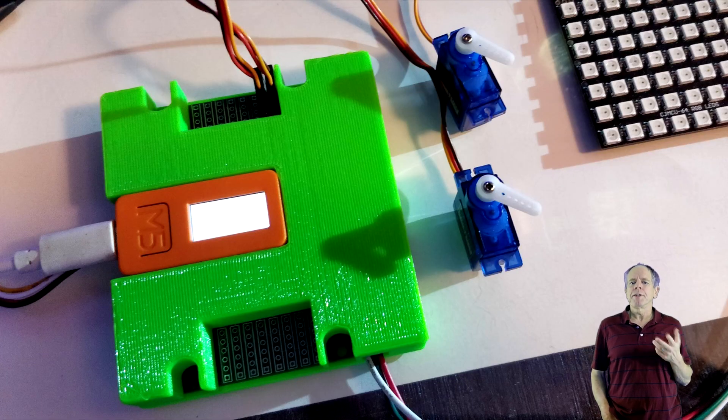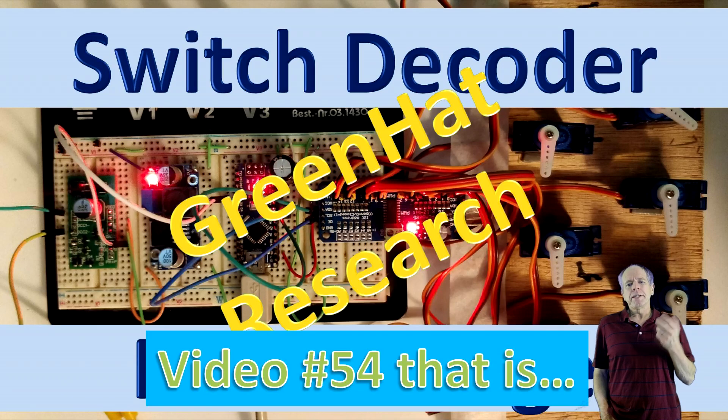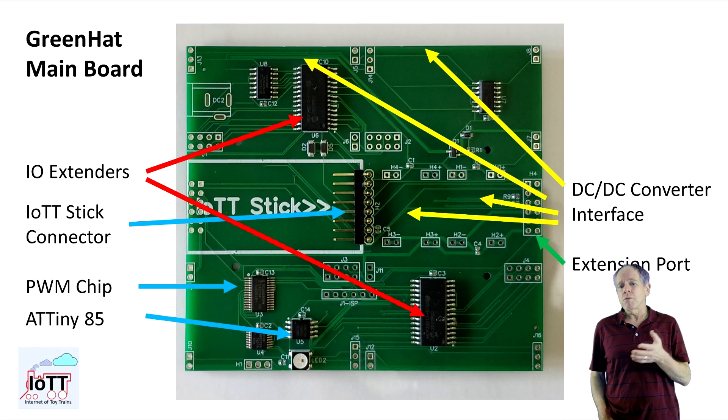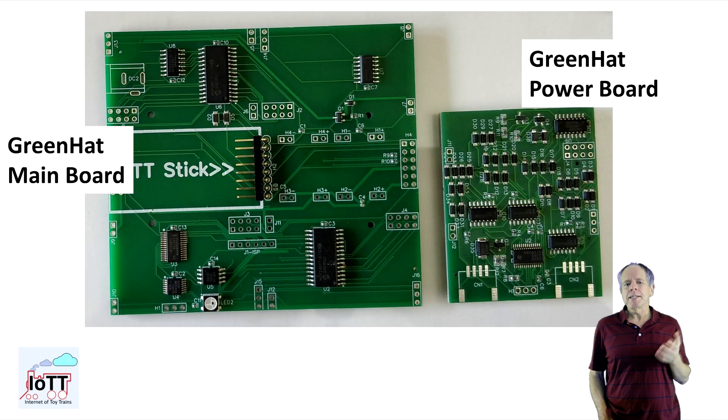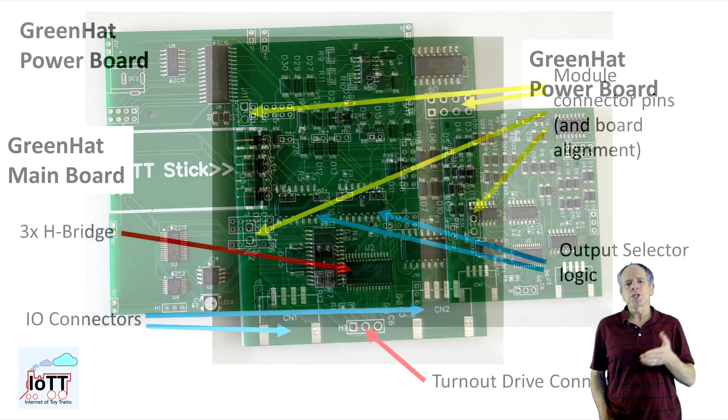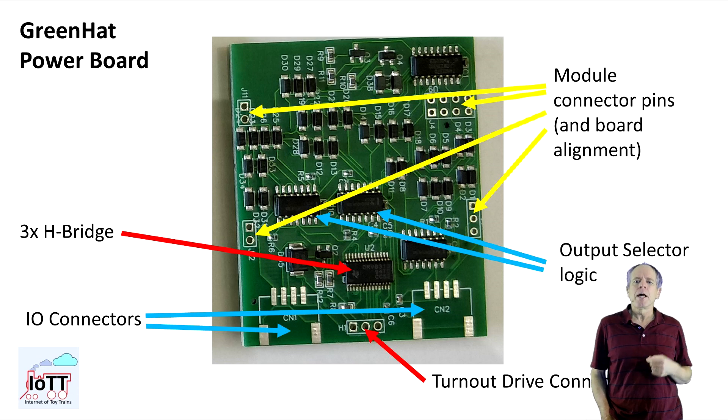Back to the topic of this video, the Green Hat Switch Decoder. In video number 45 I showed how it is possible to create a power stage that can drive all types of switch machines, from dual coils AC or DC, to bipolar coils, from stall motors to servos and even brushless motors. So I went ahead and designed the PCB — or as it turned out, the PCBs — because for space reasons I had to separate the power stage PCBs from the PCB with the common functions such as servo driver and IO chips, so that I could double stack the PCBs into a smaller housing.